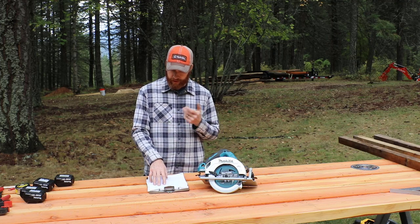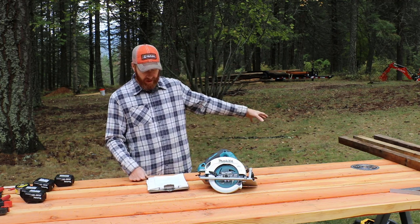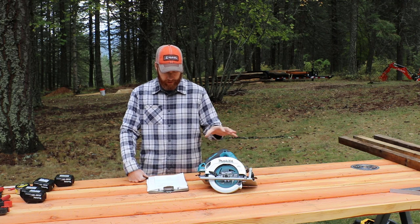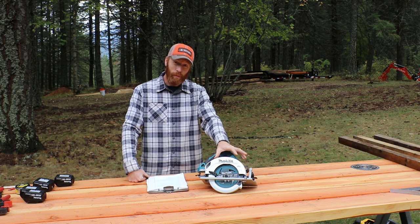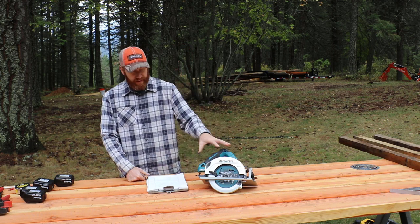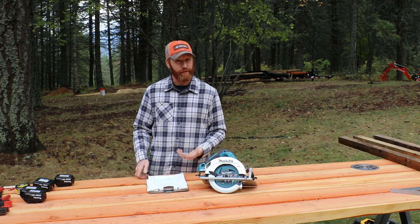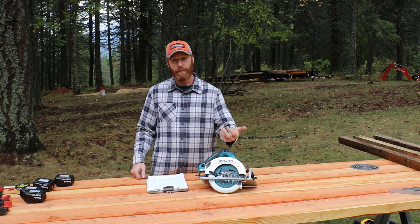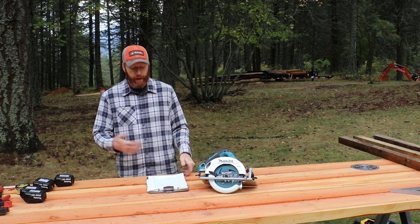And like I said, it comes in at 8 pounds, 2.3 ounces. The Skilsaw-style Makita, they say it'll cut 558. So this will cut about 40, 50 more 2x4s cross-cut wise, supposedly, with its capacity. This is 6,000 RPMs. That one's rated at 5,100 RPMs. So I don't know if it has something to do with the RPMs. Lower RPMs, I would think, would be more torque. So that might be something that might be going on there.